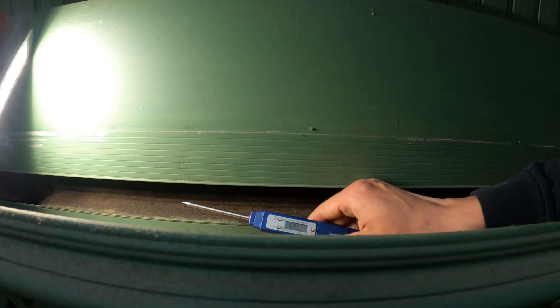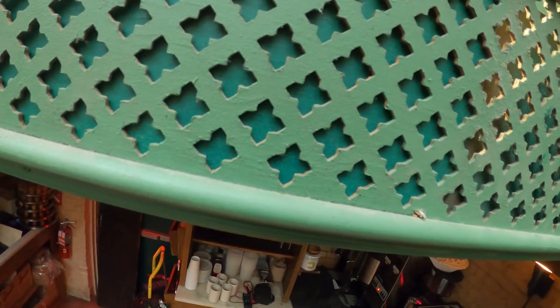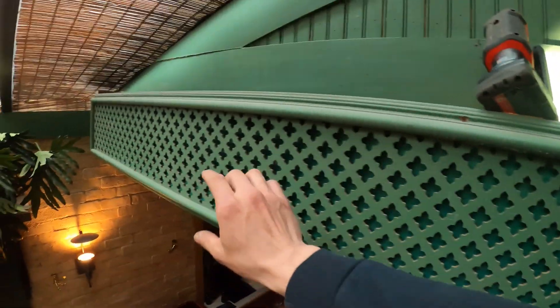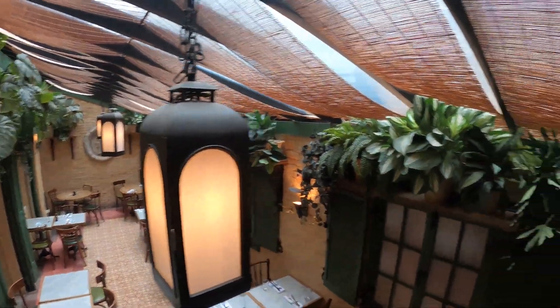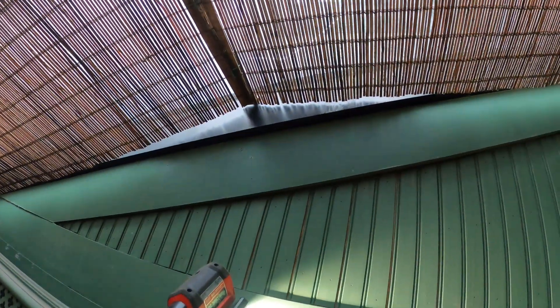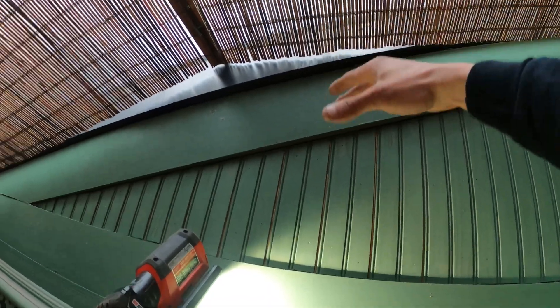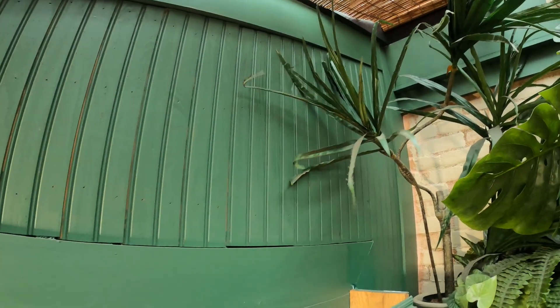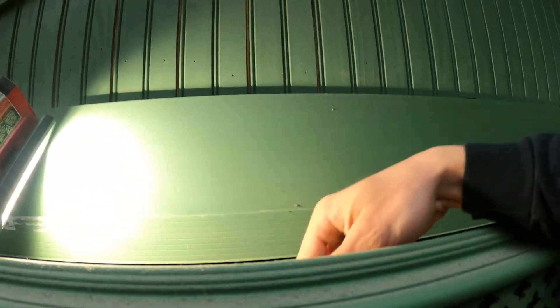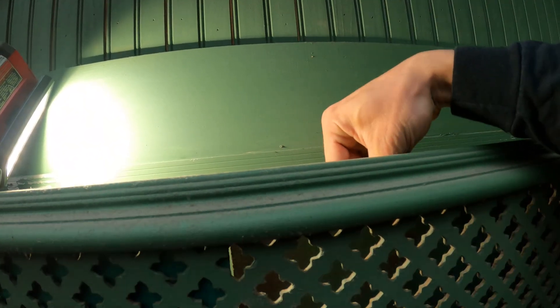The air conditioning started — that's good. This machine actually works. But look what's strange — this is the grill to cool the space, and look up, the air is blowing this way. See how that's moving? They blocked off the grill — it's not even cooling the space at all. It's cooling these leaves. We got to open this up. Why did they cover this? This has to come out.